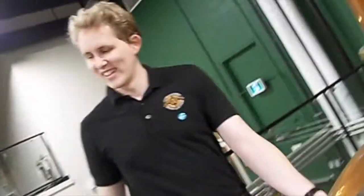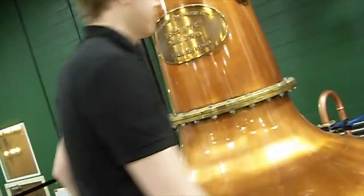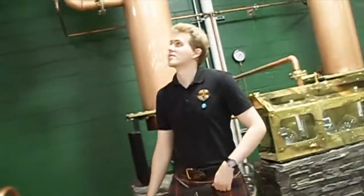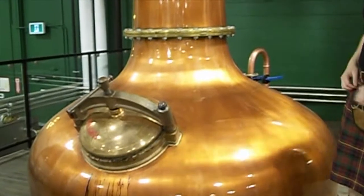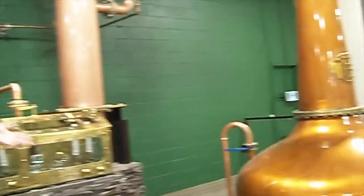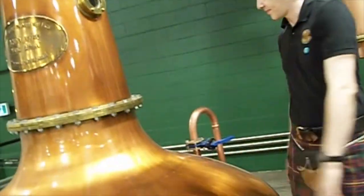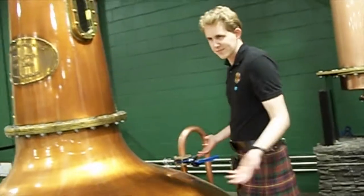That's okay. So, while you guys try that, I will talk about what these two massive copper stills might do and why they're made. In general, they're basically giant evaporation machines. We're going to add this beerish slurry, this whiskey wash, into this still and heat it up, and alcohol evaporates before water. So we heat it up.